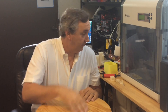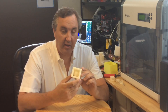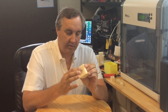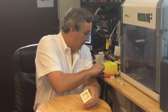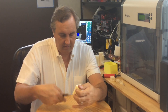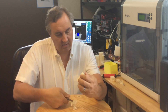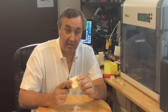Now let's see how this print turned out. Looks pretty good. It's got a lot of support to remove but the ball inside looks nice and round. It's definitely holding on the bottom. I've got support on the side to break away, but it looks like it formed around the ball nicely. I'm going to use needle nose pliers — pull these out and it just tears away. It's actually pretty easy support to break away, and I set it at the finest setting, so that makes it easier. It's only really touching at the top and bottom, and a little on the sides, but it's breaking away pretty easy.